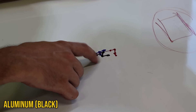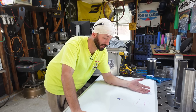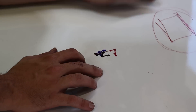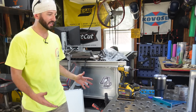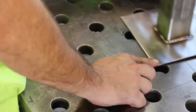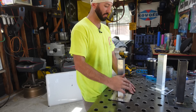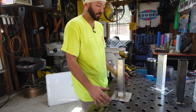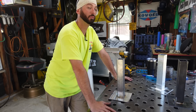If you don't fix something or it's not fixed to something already, it's going to move — a lot — so you have to be prepared for it. The aluminum moved a lot too, just a lot slower — it takes a little bit of time to get to that point. Stainless when it cools, it cools quick and then it pulls hard. Aluminum is more of a slow pull. Also, look at all that floppy sloppiness — that's the distortion of the plate it was welded to. The bottom plate is bowing up every time. If you weld something to one side, it always bows that direction.